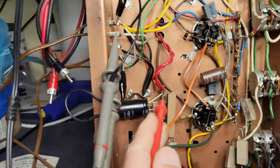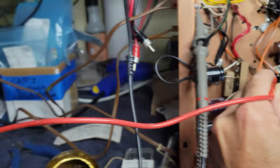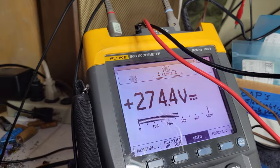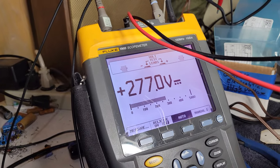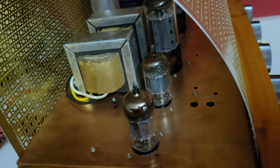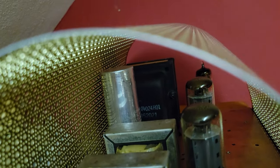I am getting higher voltages. My B+ here is now 316. The plates, which I recall were at 305 — 308. Here's the screen grid: 275. Supply for the triodes: 277. I kept the original circuit, original transformers, original output transformers, original power transformer, original tubes — just a couple of 12AX7s, then two 7591s and a 6CA4 rectifier on the end.